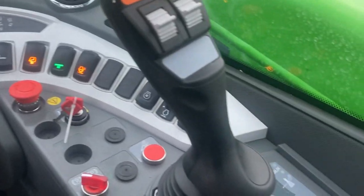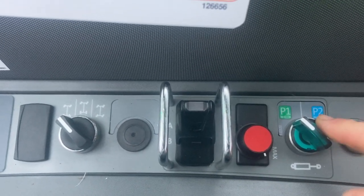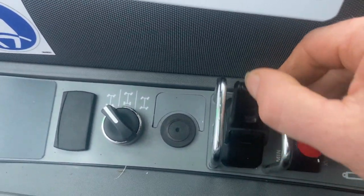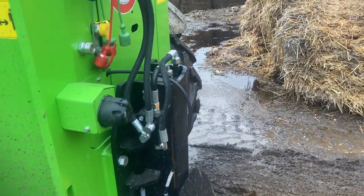I've moved this trailer out the way. It's got a very good lift on the rear hitch. The bales I had on there were right at the front - it didn't feel it right full, which means it's heavier - and it lifted it easily, which is probably better than the JCB, because the JCB sometimes struggles to lift that trailer up. This is how you do the hitch. This one here is the rear hitch, this one here is the auxiliary spool, so you just turn it like that to get the other one. You do that and then lift it up. Then you go around the other side of the seat, pull this lever up, and go around here and put this lever down, and that puts the hitch down. This is the back hitch, which is very powerful - it's got a very good lift.